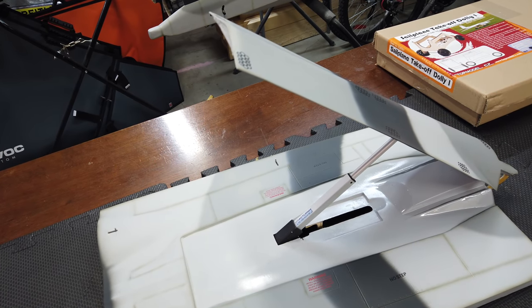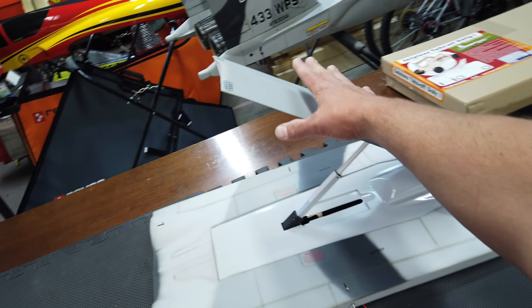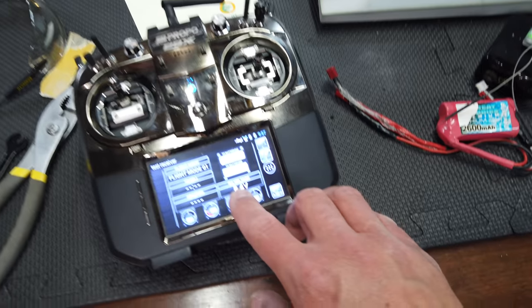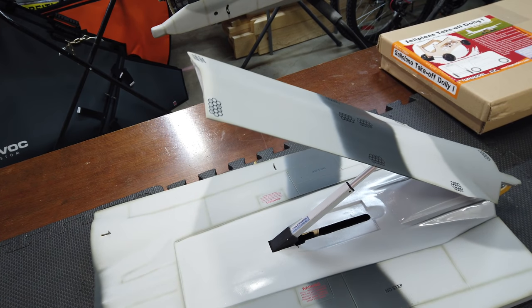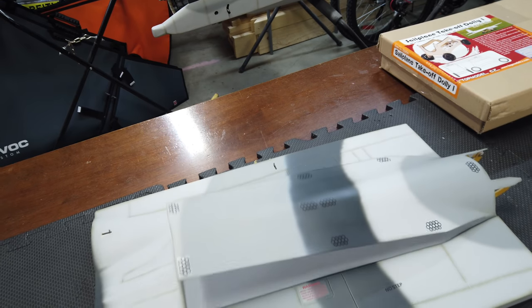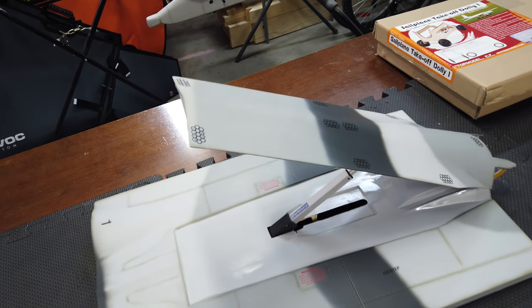The mechanics work great. I tried it with a life battery at around 6 volts — it works but doesn't have a ton of power; providing some resistance while it extends makes it struggle a bit. With a lithium-ion at 8.4 volts it works nicely. I put my hand on it applying a couple pounds of force while it's extending and it handles it well — the mechanics are awesome.